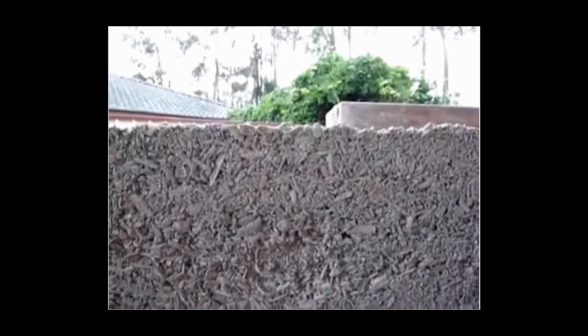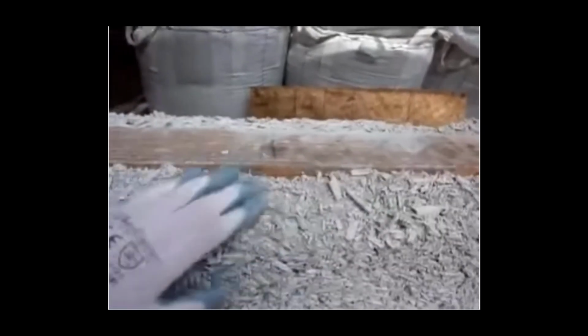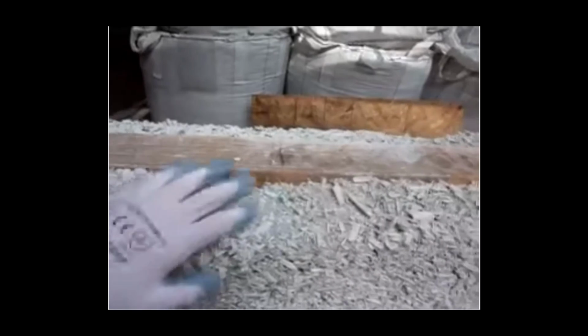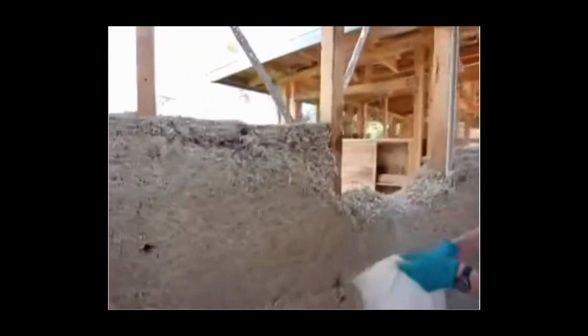9 litres of water. It appears that this is not just an isolated problem, as all along the wall, wherever we brush it, large amounts of hemp are just sort of falling out. This is the really dry mix. You can see how at the top, I just rub my hand along and it's just all completely crumbling away. Underneath the windowsill, the hemp is extremely flaky. We're very concerned that the render wouldn't stick to this, and the windowsill would be a particularly vulnerable point. The section above where a spacer was, again, just crumbling away with only a very light touch. This is in contrast to the wetter mixes we've done where you get a tiny little bit flaking off, but really it's very hard and firm right up to that top layer. and the unstable hempcrete had to be removed.